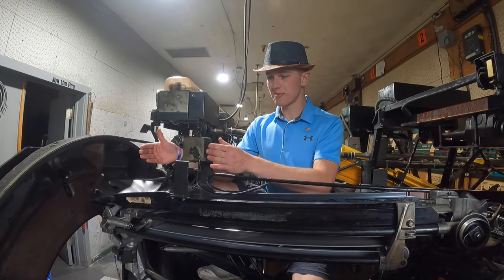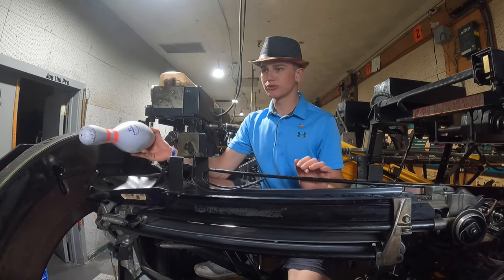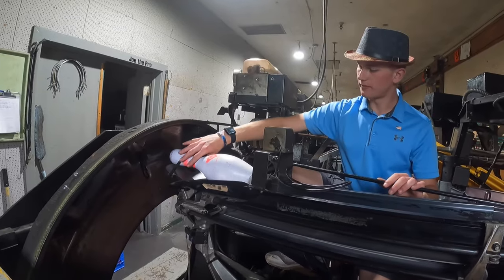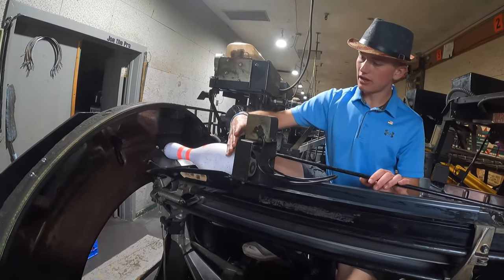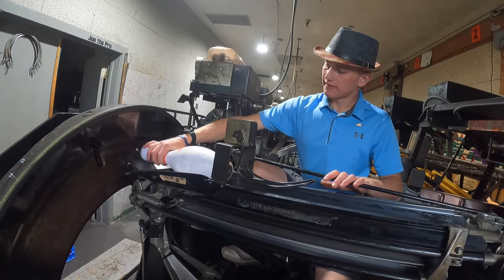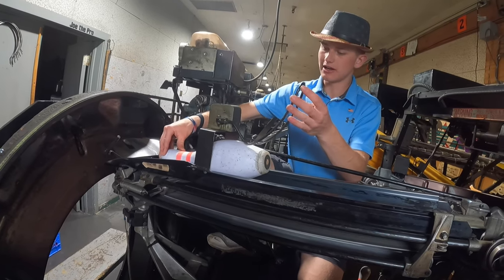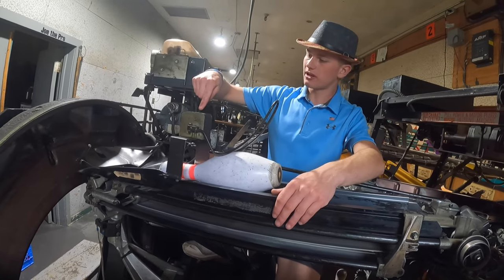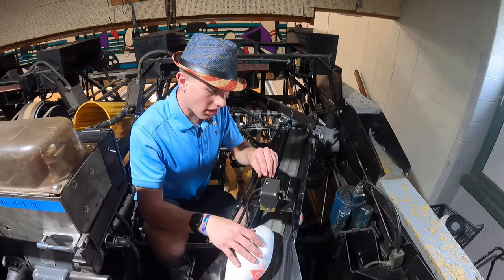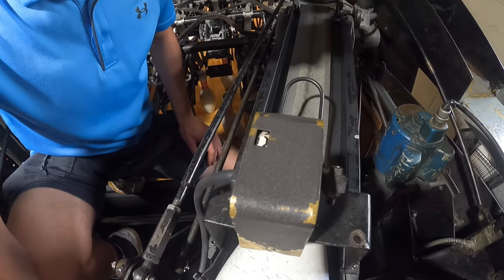You'll find it kind of towards the back of the distributor. I'll grab a pin from the table to show you with the machine off, and then we will do a demonstration with the power on. As the pins are coming up the pinwheel and falling onto the distributor to be fed into the table, they are going to pass through this threshold here — this is actually a pin counting device. What activates it is this hot dog looking mechanism here. When the pins are traveling through the threshold, the bottom of the pin pushes on the lever, or the hot dog, and it passes under there. As it's passing under there, if you look above, it's counting each and every pin that passes through it.